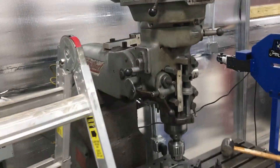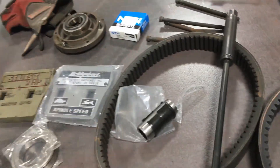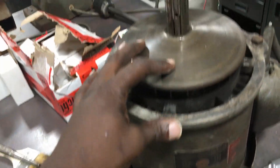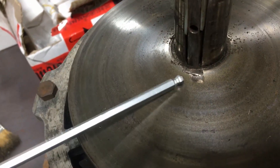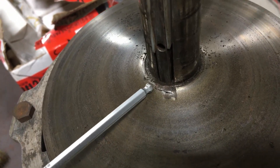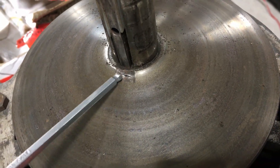I took out the drawbar out of here, and the drawbar is here. I wanted to look at the spindle. I also took the adjustable motor disc off of the motor, and the first issue I ran up against — if we look here, that's cracked. It's cleanly cracked too. Strange. Almost like a manufacturing defect, but there's a little recess right here and it's cracked along here. So that's issue number one.